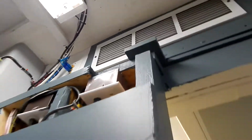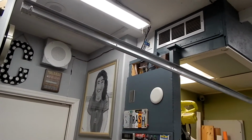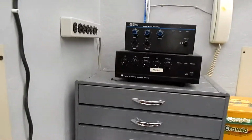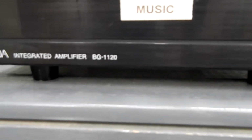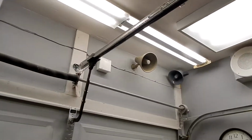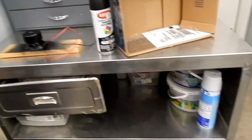And it was up for maybe 6 months, maybe a year, and then I ended up removing it because I upgraded to a total amplifier. Not this one you see here. It was actually my very first 70 volt amp, a BG60. I had to convert at least a few speakers I had at the time to 70 volts. And this wasn't 70 volts. This was on an 8 ohm tap, as well as some of the speakers that were in here in the past.